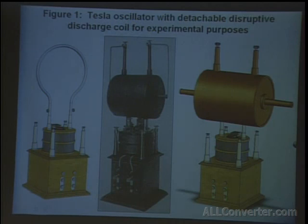The device has proved highly serviceable in carrying on laboratory experiments of all kinds. For instance, in studying the phenomenon of impedance, the transformer was removed and a bent copper bar inserted into the terminals. This is what you see to the left. The latter was often replaced by a large circular loop to exhibit inductive effects at a distance or to excite resonant circuits used in various investigations and measurements. A transformer suitable for any desired performance could be readily improvised and attached to the terminals, and in this way much time and labor was saved.